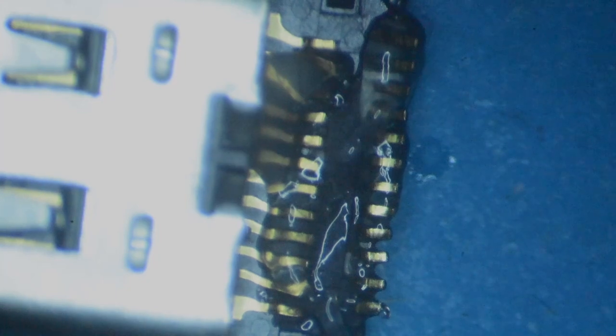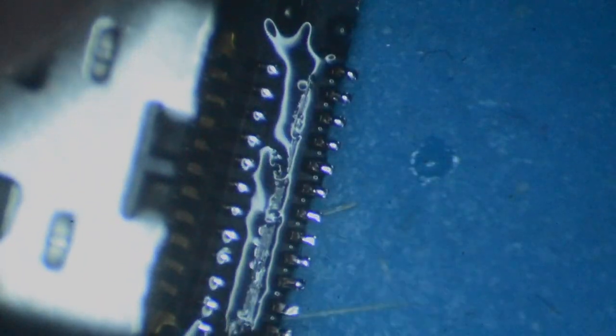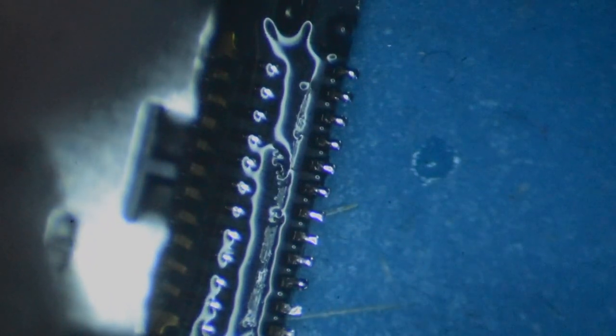Grab your soldering iron. The soldering iron I'm using is a Pace ADS200 at 700 degrees Fahrenheit. The flux I'm using is Amtec 559. So these pins now have solder on them, and the board has leaded solder on the pads — that means when this port goes on the board, these pins are all going to bond very well. Also, good practice is to put flux on these anchors and add leaded solder to them as well — it's going to help them flow super easy when we reflow the port in.